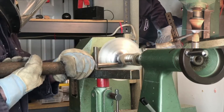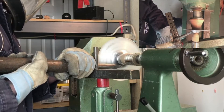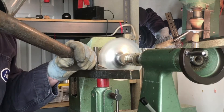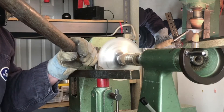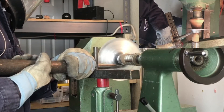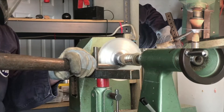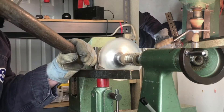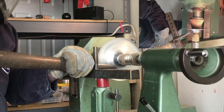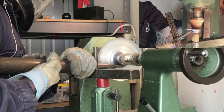Usually right at the point where the metal is contacting the chuck there's a fair amount of force, and you can see it burnishing or polishing the metal. Then I'm gradually decreasing the amount of force I'm using out to the edge. If I use too much force at the edge I can wrinkle or collapse the form — and those of you that have done this, don't feel bad. It still happens even to very experienced people like myself. I think that's well seated on the chuck there.